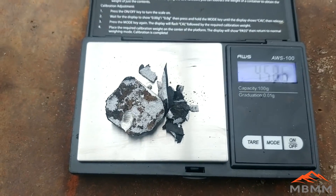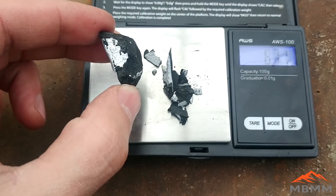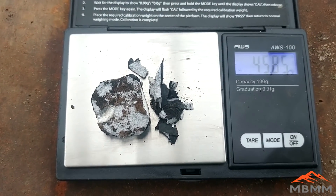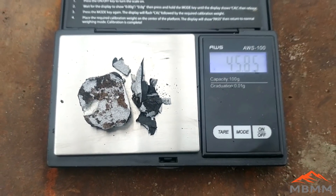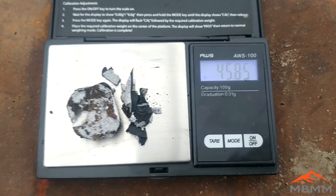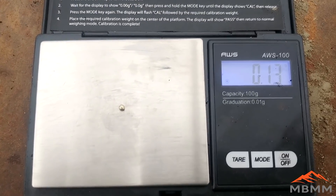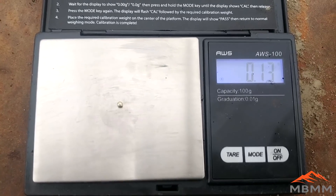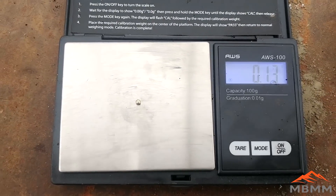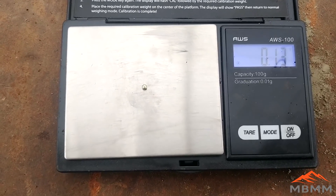I was able to recover most of the lead — almost all the lead — from that basic slag. Total weight is almost 46 grams, so we got back almost all our lead. Now let's cupel it and see if we can get as large a button as we did with our Chapman flux and roasted sulfides. Here is our last one, the soda iron method. We recovered a significant amount of gold with no mat — 0.13 grams. The most we recovered was with the roasted sulfides, which was 0.15 grams. Let me get all the beads lined out here so we can take a look at their sizes.